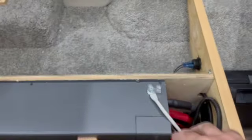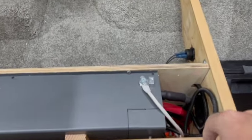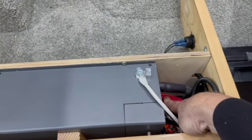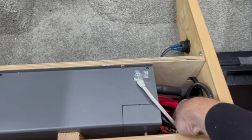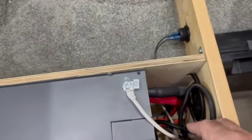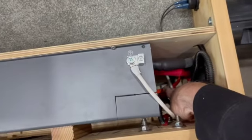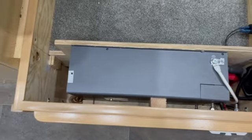So I think that's the most difficult element of this install. Actually, the two wiring pieces are just extending this 12-volt DC cable, and then swapping out the AC cord to a higher gauge, a 10 gauge wire to handle the 30 amps. So I think it came out really well.